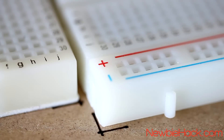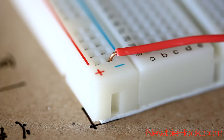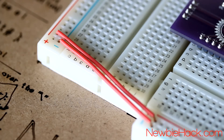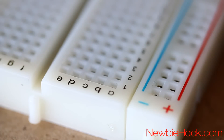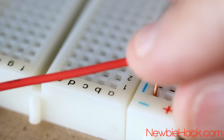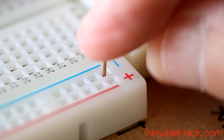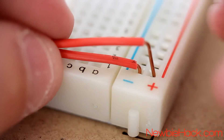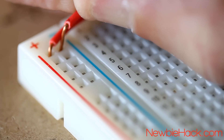Let's get started. We'll take the first wire from the negative to the negative on the other side, and then from the positive to the positive. This side is complete; now we'll do the other side, connecting these two power rails together. We'll start with the negative, which is ground, to the negative on the other power rail, and then from the positive back to the positive. I want to make sure the two wires are not touching, so I'm going to move them apart a little bit.